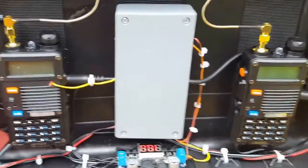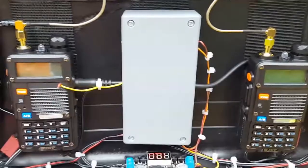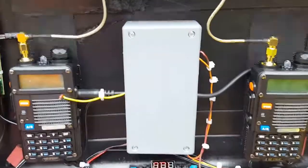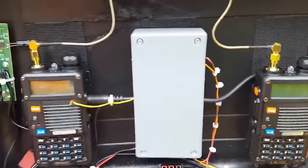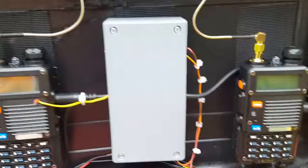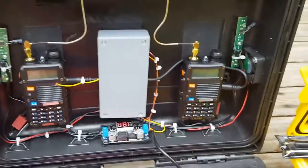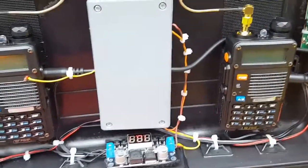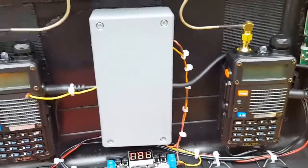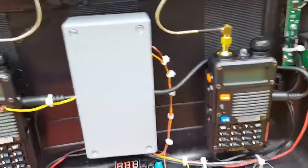Then I got it all done and my audio was almost non-existent. This is another issue people have, and I came up with a fix. The output voltage of the Baofeng audio circuit is about four volts max, but the Idiom-Matic likes higher voltage input from a mobile unit audio output - it was kind of designed for the Motorola MaxTrac. I experimented with VOX for a while and found the audio between the handhelds was good, so I ended up tying the audio in parallel to the repeater board and put in a Zener diode for the output. I still have the beacon, the ID, and all the repeater functions - the COR still transmits and it works great: good audio, plenty of audio, good signal.